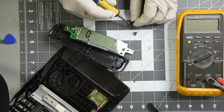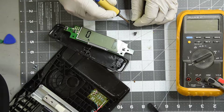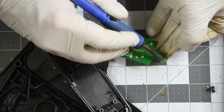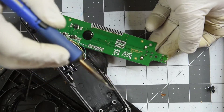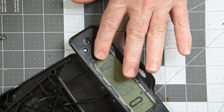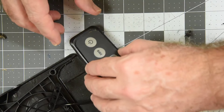Of course none of my switches have the right link shaft — either too short or too long. But I can make the long one shorter easier than making the short one longer, so I'll do that and give it a try. Well, still a bit too much sticking up, I'll just melt it down a bit. That feels about even. The switches I have don't have quite the click force that the old one had, but it should work fine.